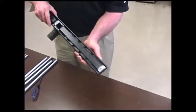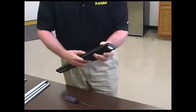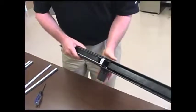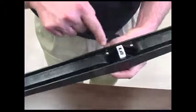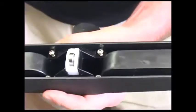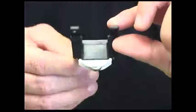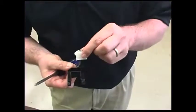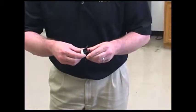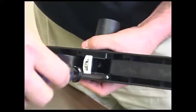The 28-inch squeegee head has three sets of wheels. The two outer wheels are changed in the same way as the 14-inch squeegee head. To change the center wheel, remove all four squeegee blades and then remove the four screws that hold the wheel bracket in place. Pull the bracket out of the head. Next, remove the screw that mounts the wheel housing to the bracket and pull the housing out. Attach the new wheel housing to the mounting bracket and screw the bracket back into the head.